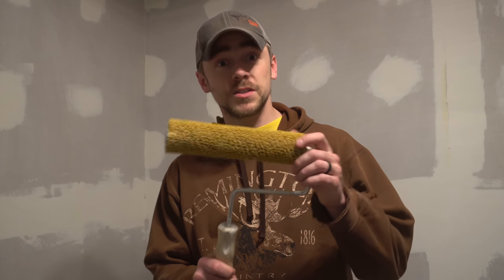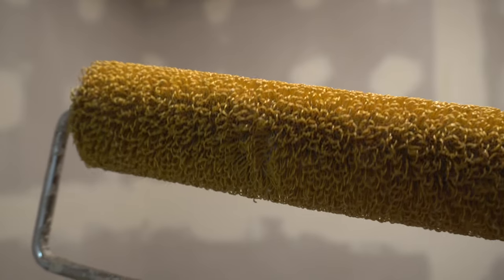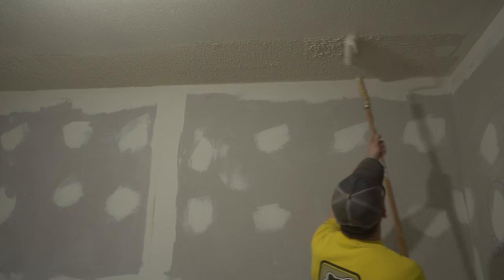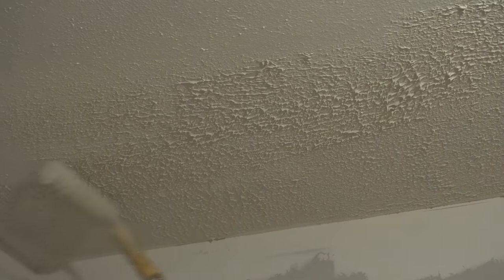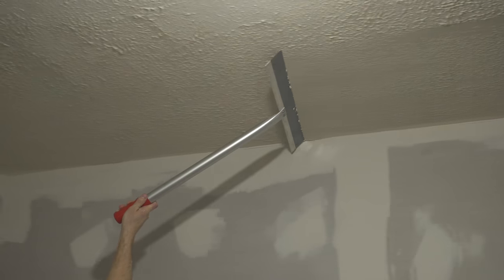At this point we've mudded and sanded a couple of different times, but if there's one thing I know, it's that I'm terrible at finishing drywall. So it's time to bring out our secret weapon. This little guy is going to help us add texture to the entire room and hide all the little imperfections that we missed. It looks a lot like your standard paint roller, but it's actually made up of a bunch of little wire hoops that pick up a whole lot of drywall mud out of the bucket. We roll it onto the wall, then come back through and knock it down with a trowel, and that leaves the wall with a nice textured effect. We've used this method in a bunch of different places over the years — we used it on the ceiling and walls in this room for a consistent look. The only drawback is the amount of extra mud you need to cover every square foot, and the only skill involved is dragging the smoothing blade at a consistent pressure so that everything looks uniform.